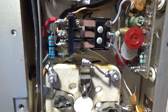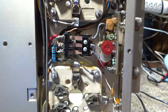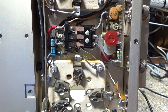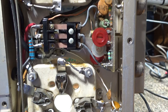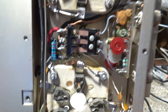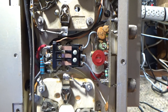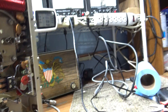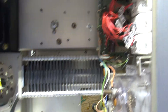This resistor is the new modified bias resistor that cuts the tubes off in standby — runs cool, doesn't draw a lot of power, not a lot of heat. From a safety standpoint, you don't have those dropping resistors coming off 3000 volts to drop the voltage down, which is dangerous and wastes heat and power. This is an easier, modern, cheaper way to do it. Most modern amplifier companies now do it either this way or use a low-voltage supply for the bias rather than dropping off the high voltage — that older approach is pretty much obsolete.